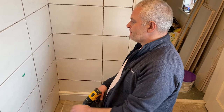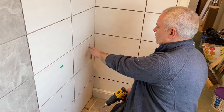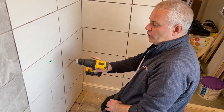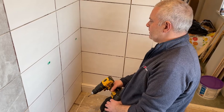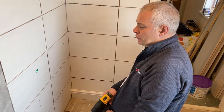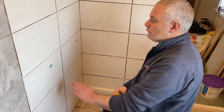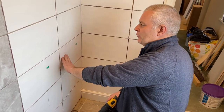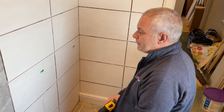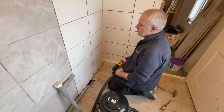So we've got to drill the tiles now. We've marked out a couple of places for where the cupboard is going and we've decided on the left hand location. I've got a tile drill bit in my drill and I've got my drill selected to drill, not hammer, because we don't want to put any pressure on the tiles. One of the things about these tiles we've noticed is the brown on the back - the terracotta - and this makes a lot of dust. So I'm going to set off and put a little score mark in there with my tile drill bit. If you find that your tile drill bit is slipping over your tiles, you can just put a bit of insulation tape over and that stops it slipping about. Because of the dust that is created I'm going to put the hoover on and drill through the tile.